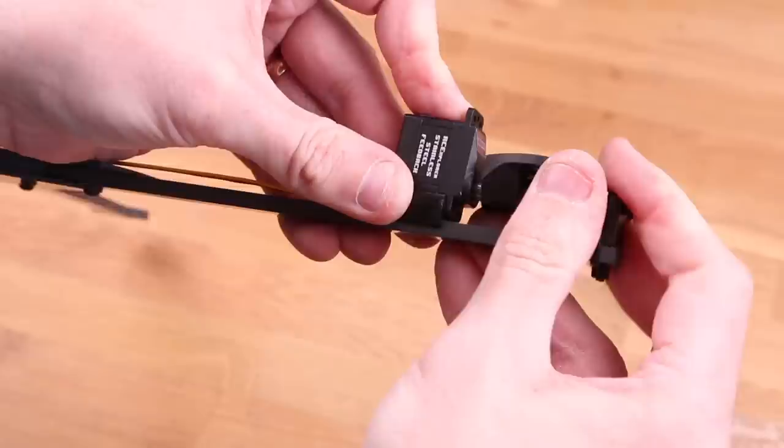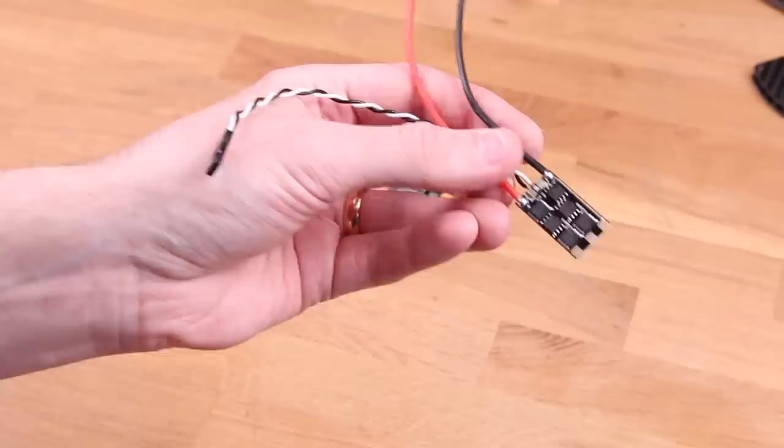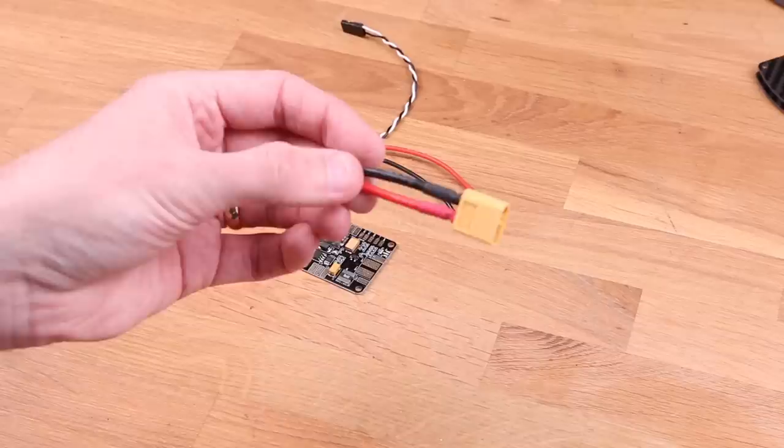Ooh, it's time to start with the electronics. First thing we're gonna do is start soldering all kinds of cables to the baby PDB here, like the speed controllers and the battery wire. Pre-tin the parts and don't use too high of a temperature. Rather, use a soldering iron that has a lot of wattage behind it.